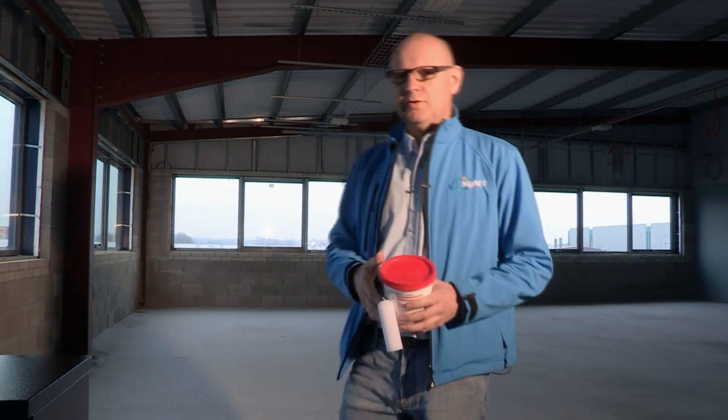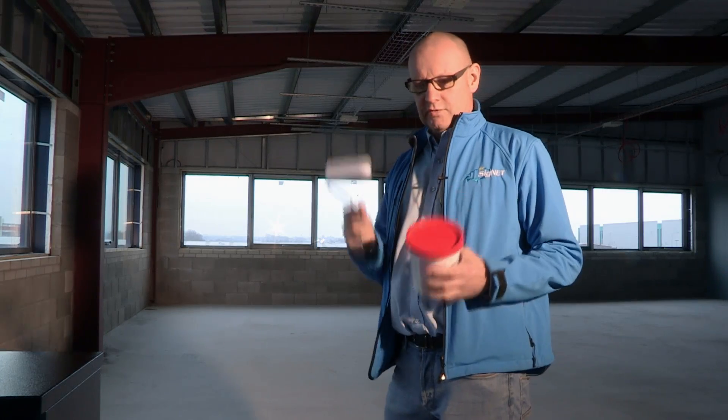Before we start laying the loop, it's important to evaluate how suitable the floor is. Sometimes you won't get a floor as clean as this — sometimes it'll be quite dirty and there'll be bits. So you need to sweep it and maybe consider using a roller and some glue or bonding agent that will go down first to stick the loop cable to the floor. But in this case it's quite a clean floor so we don't need to do that. We're just going to lay the copper straight out on top of the floor.